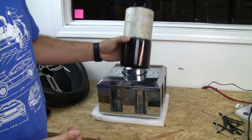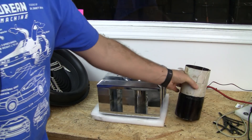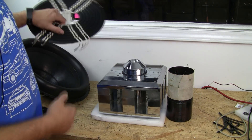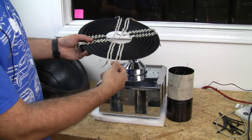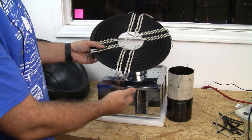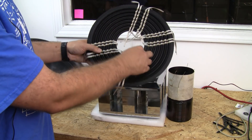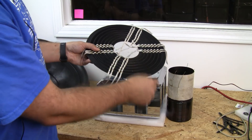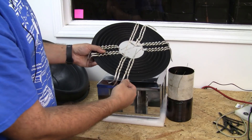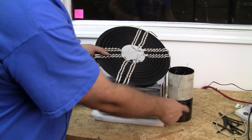That is how all of these parts work together. The way you get power from the terminals into the leads — you might have push terminals or direct leads — those are connected to the basket and go into the tinsel leads. The tinsel leads go onto this end, which gets soldered onto this end of the coil. So the path goes from the connection, through the tinsel leads, soldered onto the coil, then back down and through the coil.